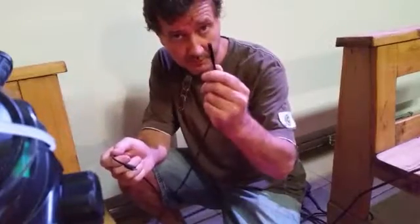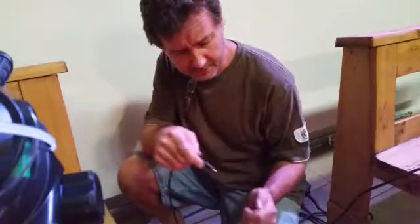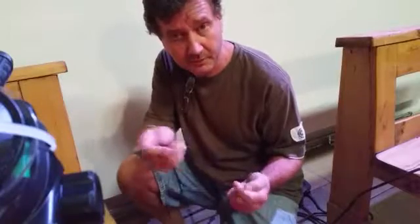We're going to continue on here — we're going to drill a hole for the signal wire to come through. Measure twice, drill once. We've got to be careful when drilling through a floor — you never know what's underneath, you'll never be 100% sure, but let's give it a go. I've got one of these little endoscope cameras that plugs into a smartphone. It's lit up with LEDs around the edge. I'll stick it down the hole to check it out and record the video to play back for you.